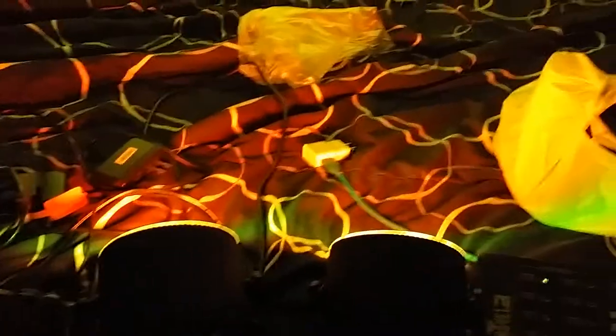All the lights in the first nine channels use the same functions. As you can see, whenever I change colors they're both changing the same. You can see the spots on the wall — they're working just fine, which means they are the exact same in DMX programming. Channel 2 is your red — as you can see it's the exact same. I'm going to turn up fader 3, which is green — you can see it's the same brightness. Turn up fader 4, which is your blue — exact same brightness. Turn them all up and there's your white.